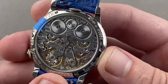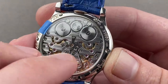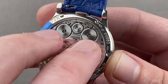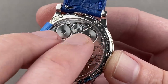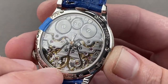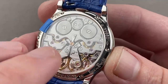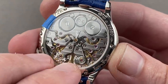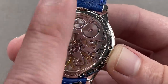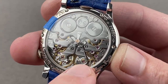Turning it over, you can see the movement is made of brass and you can see the ratchet wheels — this is a Resonance One. For the Resonance Two, where you would have had rose gold bridges, you just see the pivot jewels of the barrel arbors. Here you can actually see the ratchet wheels. Brass is more collectible. If you're an F.P. Journe collector, rose gold is more valuable as a commodity, but we're buying these as collectibles — brass is more desirable. We have barrel, drivetrain, escapement, and balance totally independent. Two movements in one case, nothing coupling them together but the resonance phenomenon.